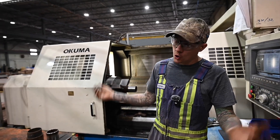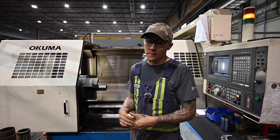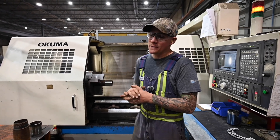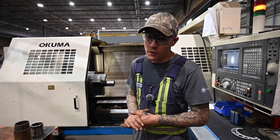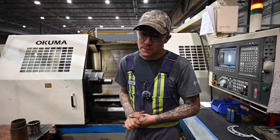Welcome back to Gordon at Pinnacle Drilling. It's been a while — we missed you guys. Anyway, today we are making an odd size Acme thread. It's just the kind of diameter we're working with. It is a 4.475 diameter, 8 threads per inch stub Acme.